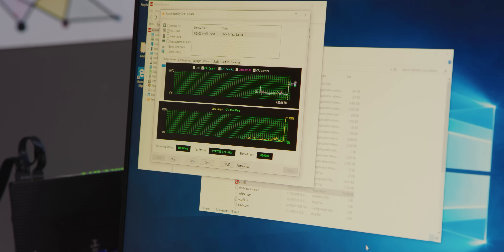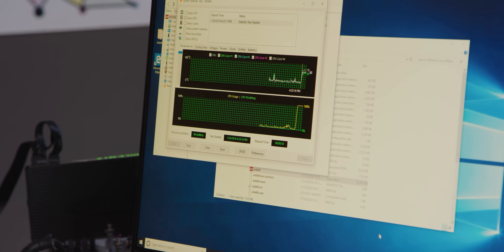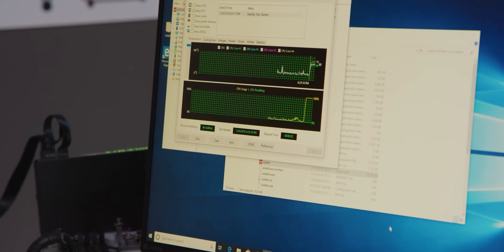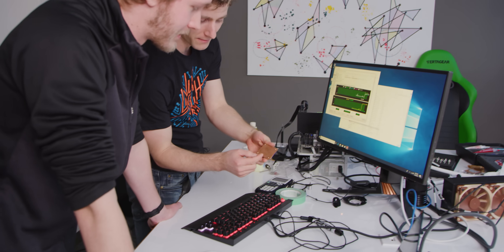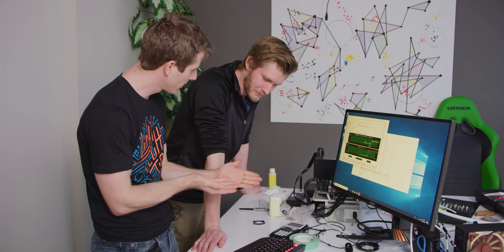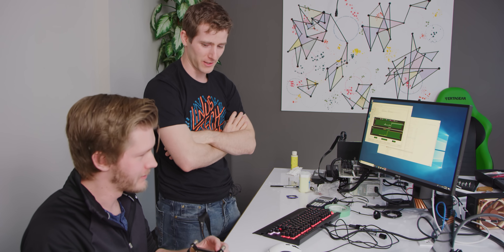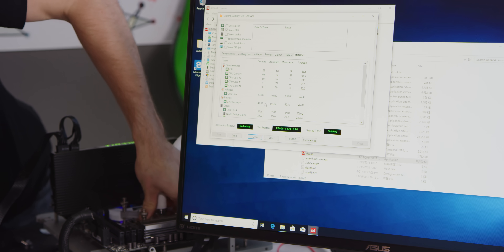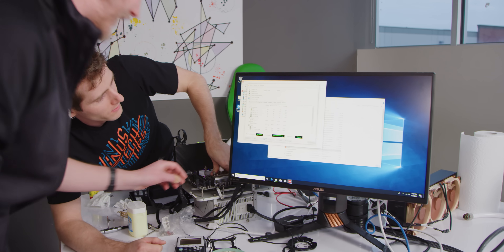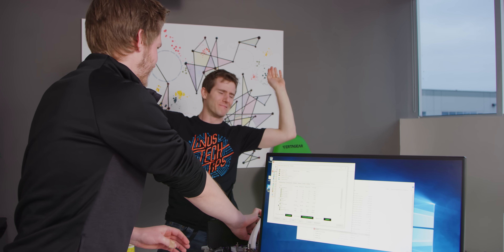So here comes the heat — max of 82 degrees to beat. The AliExpress block, which we think is even more cheaply constructed than ours, is the one to beat. EK is 64 degrees. We're already up to 78. Oh, on the hottest core. Also, we never machined the bottom, which they clearly did. Have you seen what Swiftech does with their skived thing where it slices into the metal and folds up a slice? No. It's amazing. Can we get one of those machines? Nope. And we're at 83 degrees — damn it. Actually it settled back into 81. I wonder if that was me pushing on it — you can't design a product to have the user just hold it down. But we can tighten these a bit more. Victory — 80 degrees! We beat AliExpress. For a higher cost.